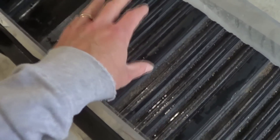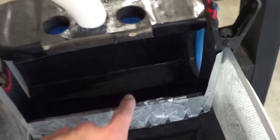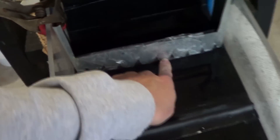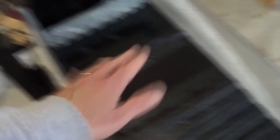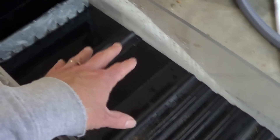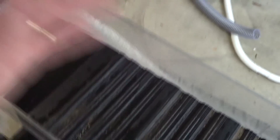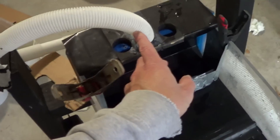I'm finding that that flow rate runs probably the best that I've seen. You really have to have some kind of device in here to smooth out your water, because you're running at a low GPH — it's a lot like a miller table. You want to get this smooth all the way across, get it level. The goal was to make a mat that you could put into and convert a regular high banker, sluice, or your own little system into a concentrating device. After you finish running primary, you take your cons, throw this mat in, hook on a $30 bilge pump, and that'll run your cons through and clean them down.